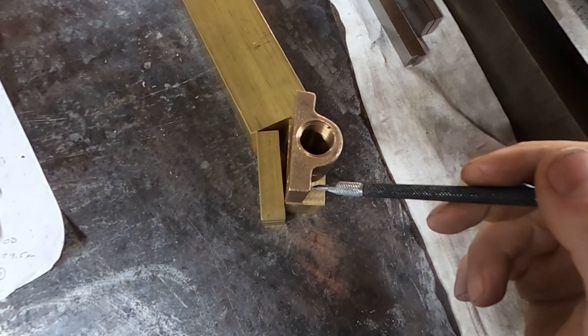After I had a basic shop drawing, I wanted to make sure that my measurements made sense as if the machine were put back together. So I used these parallel blocks, gauge blocks, and feeler gauges to stabilize the lead screw to the table the way that it would sit inside the machine, and then I took measurements from there to make sure that I had the height clearance to make a rectangular block rather than the cast block. After I verified all those measurements, it was time to use the lathe to drill the hole in the center.